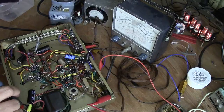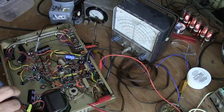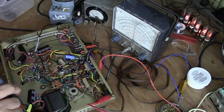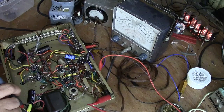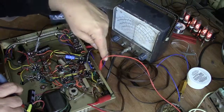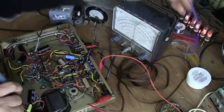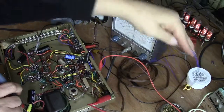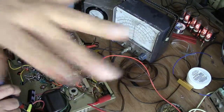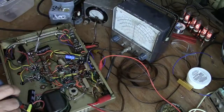And so right now we're at about 250 volts. Still no current. The pilot light over here is on. I do have a speaker connected up to one of the channels, and I have a load resistor, looks like this, for the other one. And I'm also being pretty careful in not having this hand touch anything.